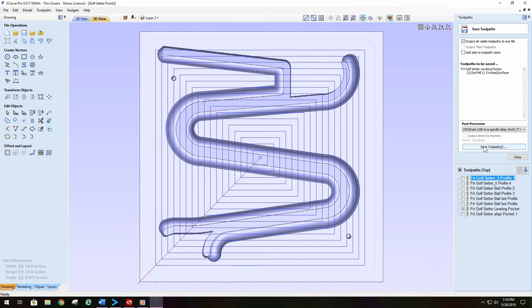This here is my spoil board cutter, but what I'm going to use it for is making sure that my blank is the right thickness. I'm not going to designate a number for this for the very fact that you can do this at the very beginning to make sure your board is the right thickness. If your board is already the right thickness because you planed it that far, you don't have to do this step.